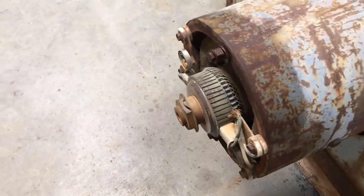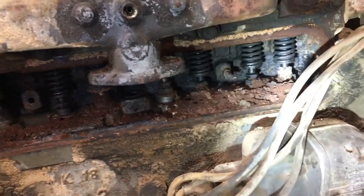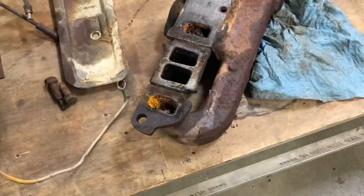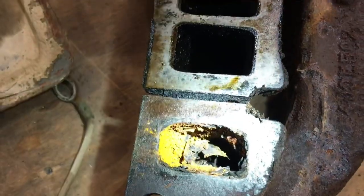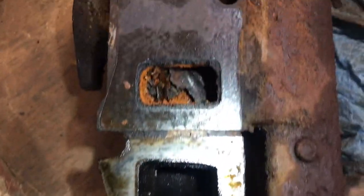She's a little rough, not bad. This one I cleaned up with a wire brush — she doesn't look too bad. I'm gonna clean all this out, spray some PB Blaster on everything and see if I can't get this thing to free up without pulling the cylinder head off. But that's probably next. Yeah, intake sides are good — exhaust is not.